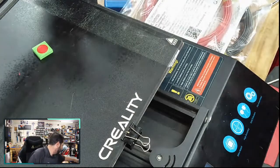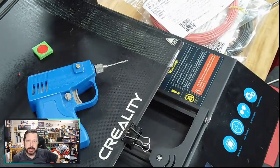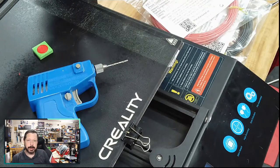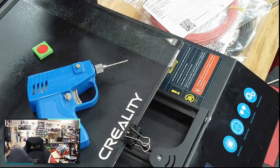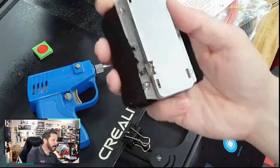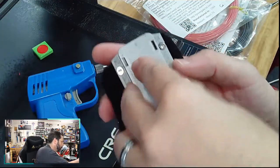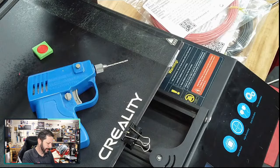Here, I noticed I had this out. No reason to get this particular thing, but I do a lot of prototype objects, and you're building one and you're trying to put some electronics in it. So I've got one. Where'd it go? Here. Got this little case, and it's got a bunch of electronics in it, and you find out I need an extra hole over here or something. So you can get a drill or even a Dremel and drill another hole in there, or even punch a hole with just a punch of some sort.